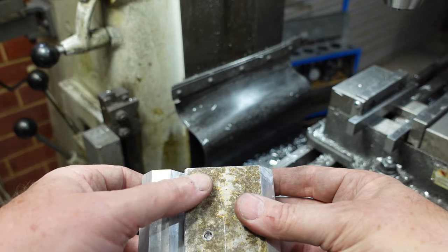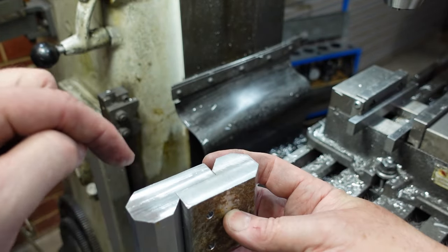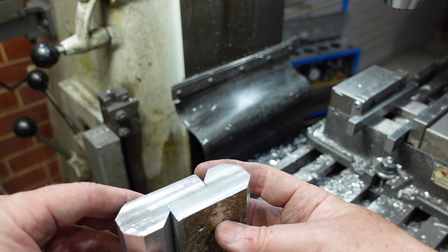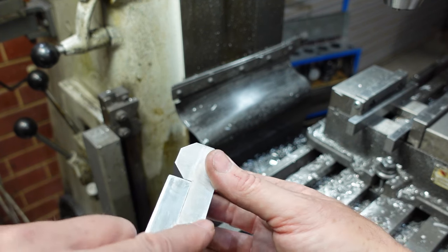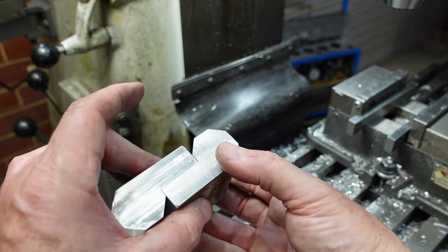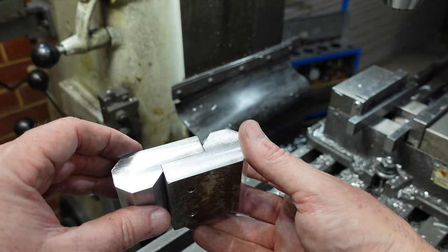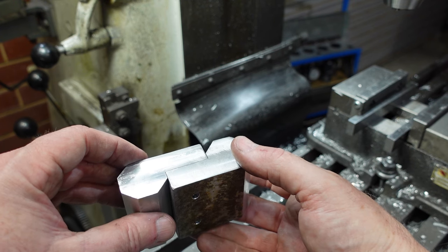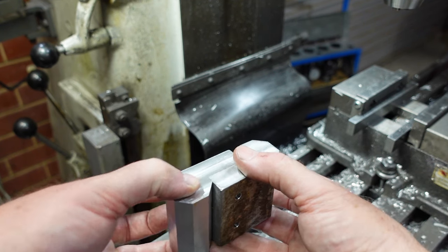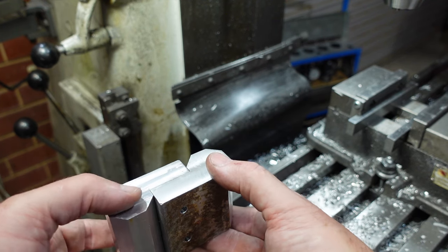Here are my two parts pinned together - quite a neat fit for the dowel pin - firm but they move. That lets me put that in a vice and drill and bore those two holes knowing they should be parallel within a quite reasonable margin. I left that thickness a little bit over half, so when I clamp it in the vice it's these two faces taking the pressure. I'm not quite sure whether I can use a vice or might have to hang it at the end and shuffle it over, but I prefer to do it in one setup.